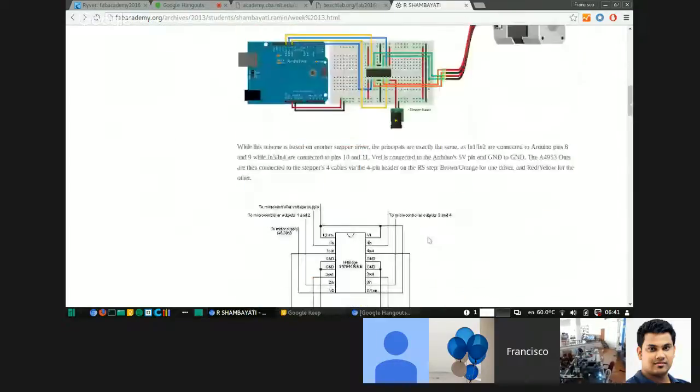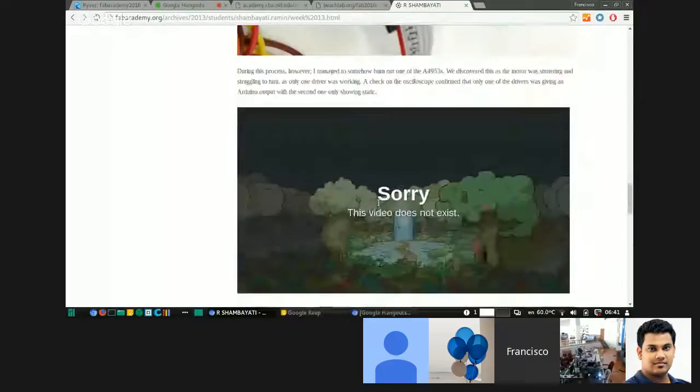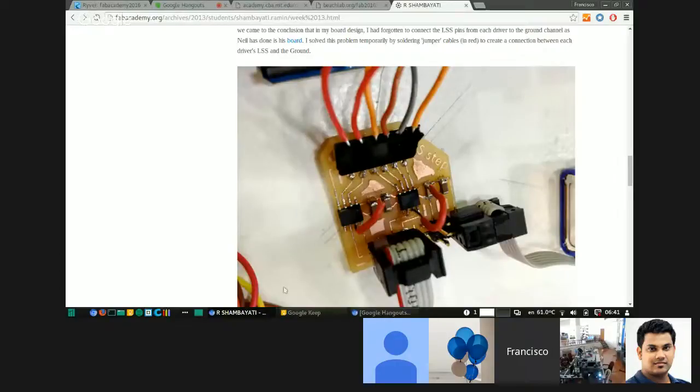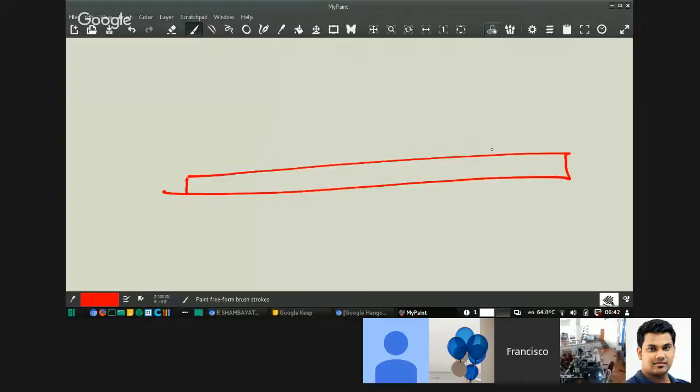Okay. And solder this component flat, the same way you solder the pin header. This is your board, and you will have the connector here with the wire coming like this, and the pad will be here. You just add a huge blob of solder here. Okay. I don't think we have this female connector.